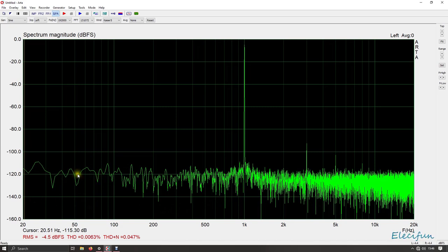But if you notice, I don't have any little peak here on 50, and I certainly don't have a peak up to about 100 on the 100 hertz, which I believe would be coming from my power supply. Because now we're running directly from the board, which means there's going to be a lot tighter circuitry, which means less interference, which is why we're not seeing it here particularly. A USB type device for doing these types of measurements could possibly be better, but I can't actually find one with a noise floor around 130 or 140.